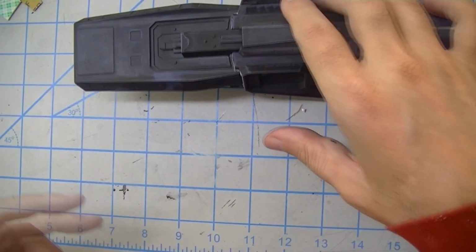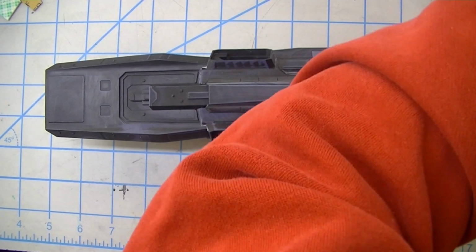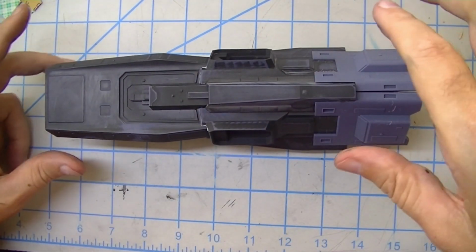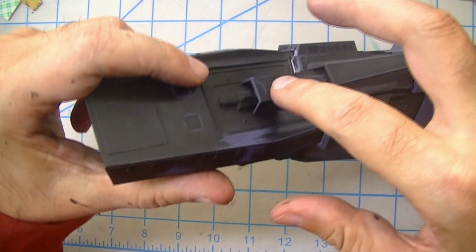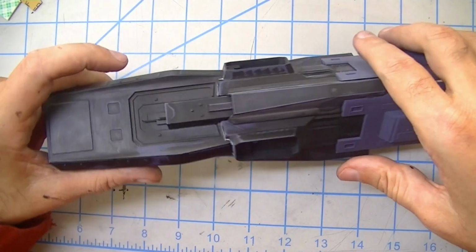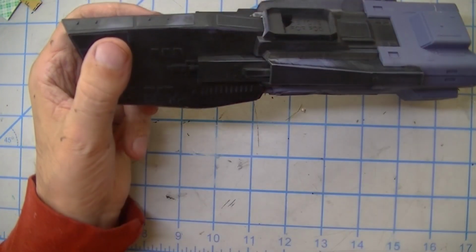I designed this entire assembly with a 0.1 millimeter, so 4 thousandths of an inch, 4 mils clearance on all sides of mating parts. So for example, where this scoop fits into its slot, 4 thousandths of an inch on all sides of every mating surface. And I felt like that was pretty reasonable, and in some places it worked great. Like these scoops, they pop right in, really nice fit.